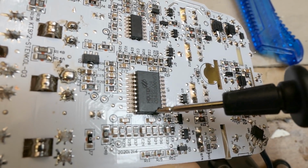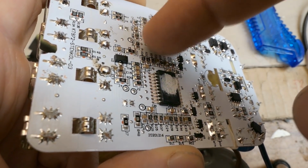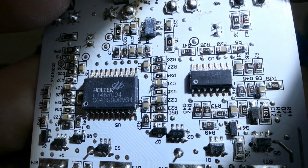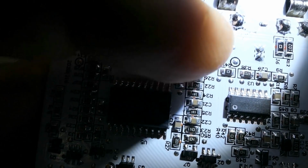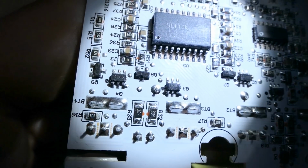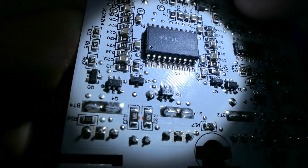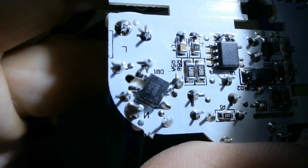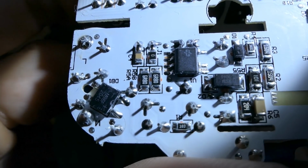Are those chips readable? Let's put some white heatsink paste on them, so they are more readable. Sometimes it helps, sometimes it makes it even worse, actually. The smaller chip is hard to read. And this one is the voltage regulator, probably. It helps a bit here, and those small 6-pin chips, they are actually easier to read in a reflection probably. And the heatsink paste worked for the bridge rectifier, not so much for the main switching power supply chip.